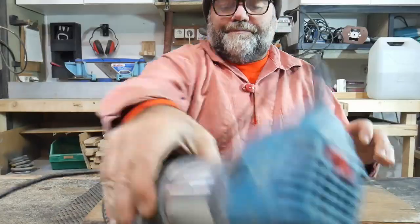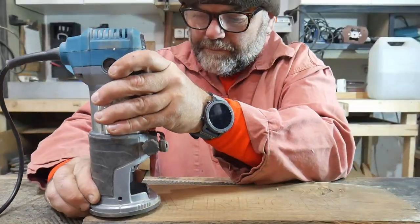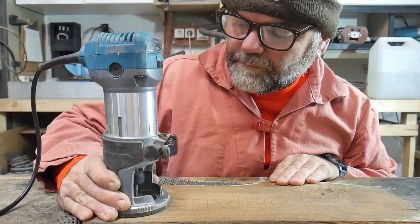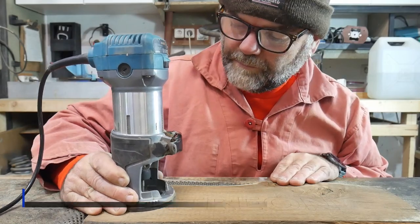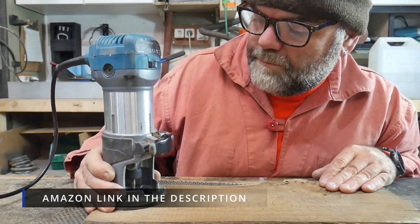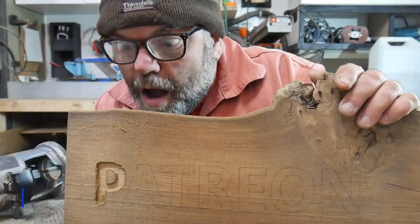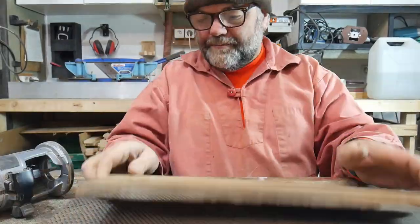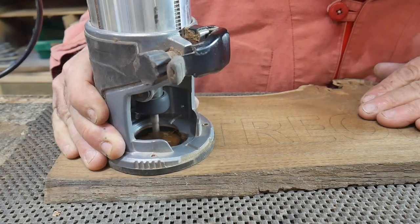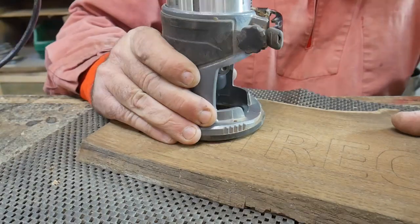We're going to use this as a hand router — it's like carving the piece of wood with a router by hand. These little Kitsu routers are quite good, apart from the visibility being a bit hard to see through the gap in the side. That's one reason I like to use my big router sometimes, but you can see it does a perfectly adequate job of routing out these letters. This is by hand, so don't expect them to be absolutely perfect — they might be a little bit wobbly, but that's not the router's fault, that's me, because I'm a bit wobbly.